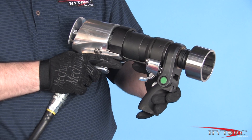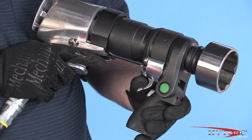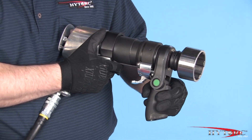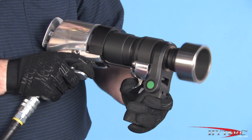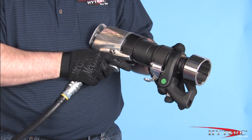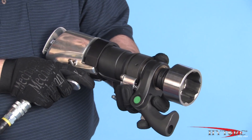The genius of the Thrill Gun is its built-in dual-speed capability, controlled by simply shifting the speed selection arm from high-speed run-down to low-speed torquing power and back again. Depress the detent and rotate the arm up into the handle position — a cam locks the tool into the high-speed position. In high-speed mode, the socket rotates at several hundred revolutions per minute, but torque is limited so the tool cannot spin or kick back. Rotating the arm down into the plane of the socket locks the tool into the low-speed mode, and the arm becomes the reaction point for torquing. In this power position, the arm cannot spin at high speed.